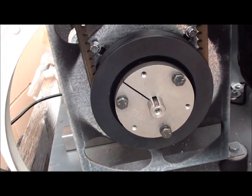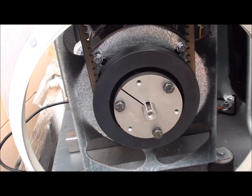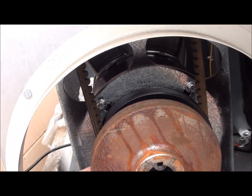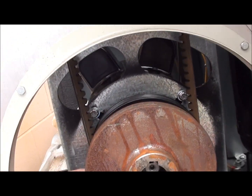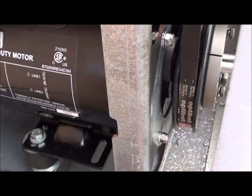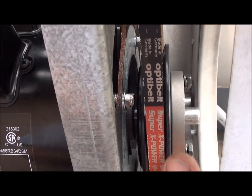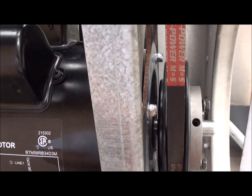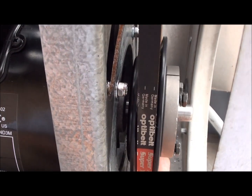Here's the arrangement. I didn't get a straight-cut pulley; I got one with a bushing in it, which makes it handy. I'm going to change this because this is a 4.8 and this is a 5.0 — small difference. There's also a small variation in that it could fit either a B belt or an A belt. It fits the belt, but it changes the pulley dimensions a little as it sits farther in the groove.